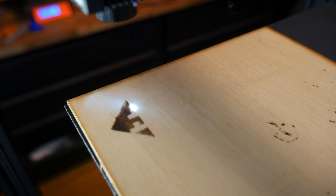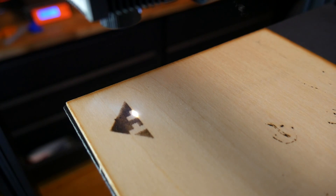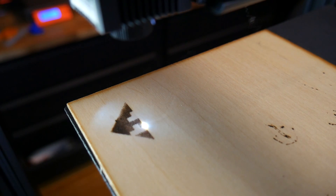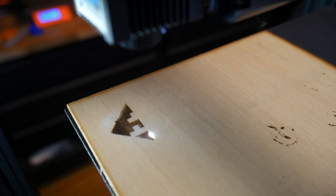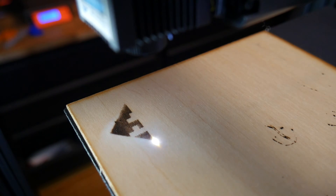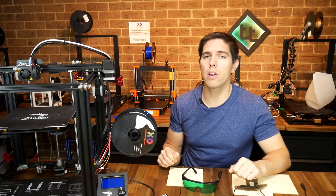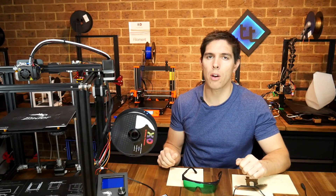You can see in this clip that the laser remains on the whole time, but in the parts where it's not drawing it just has a really low duty cycle, and then it's turned back on and off as necessary to mark the patterns on the timber. That's the theory covered on how this thing is going to work — so what's actually involved in wiring it up?